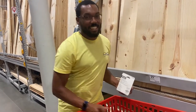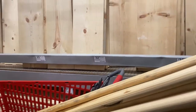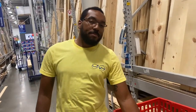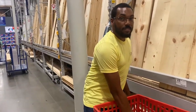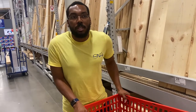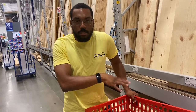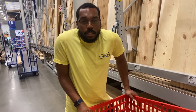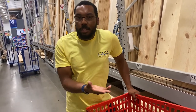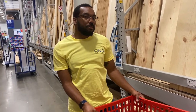Measure everything. Well, you don't necessarily have to measure the 1 inch dowels, we're not about to do that. But that's a pro tip, I would say. Super pro tip, because he just showed me they were off and I was like, whoa. If we had gotten what we thought we would need for the 15 inch base, we would end up with 0.7 of an inch worth of gap, and that would leave out one of the dowels, which would just make it look off. So just be mindful of that. Pro tip.